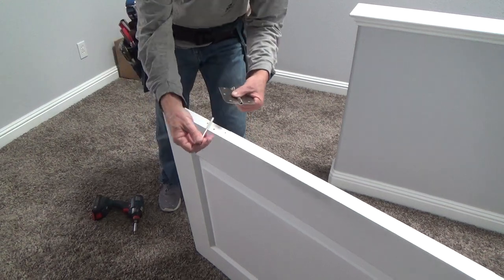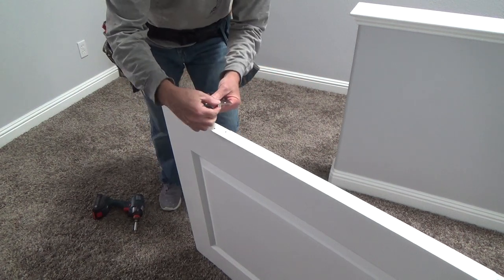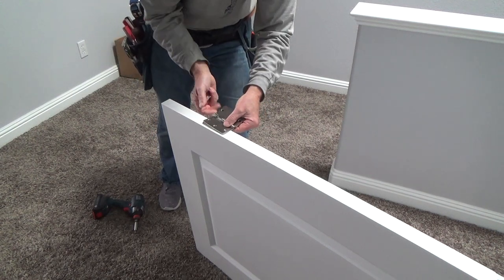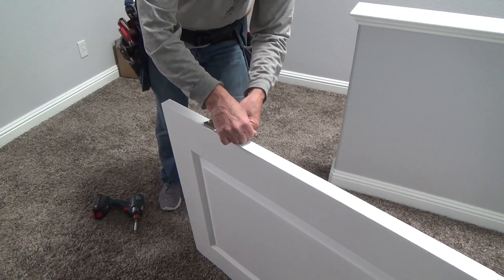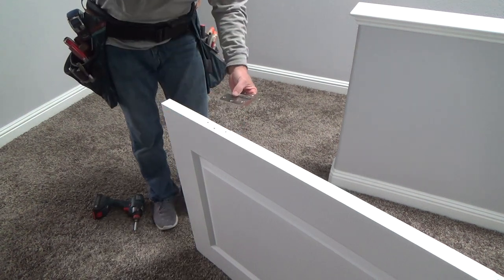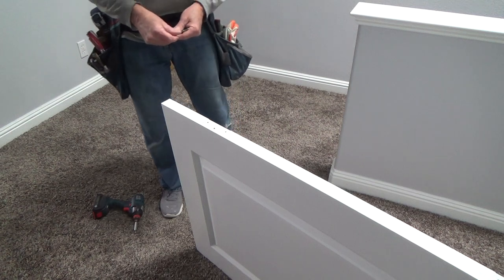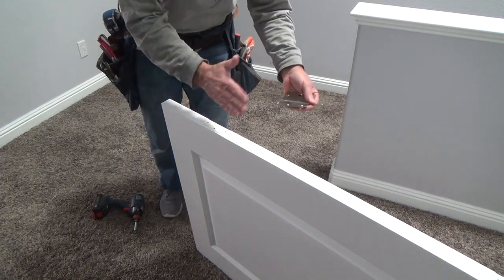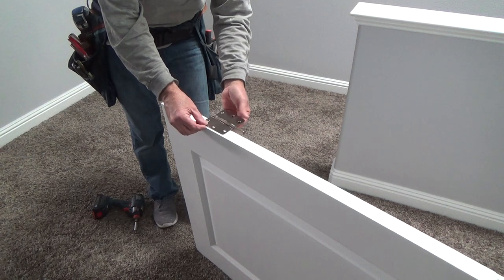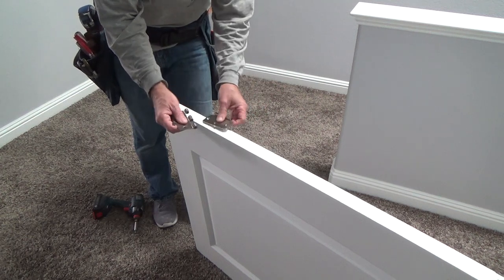I've got the door facing forward so I know which side the hinge should be facing. I don't want to put them all on and then pull the hinge pin out and have it wrong. Also, you can't set up all your doors in the same direction because left-hand swing doors and right-hand swing doors are different — sometimes you'll have three knuckles, sometimes only two.